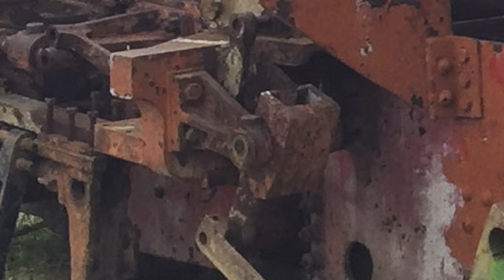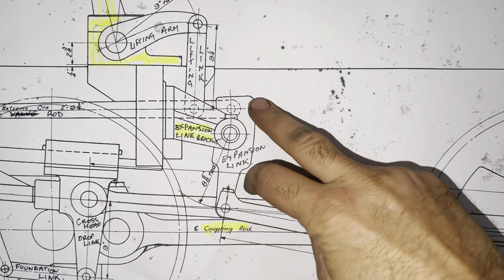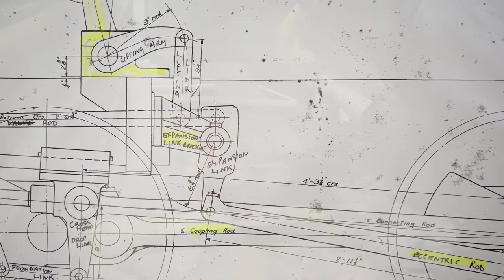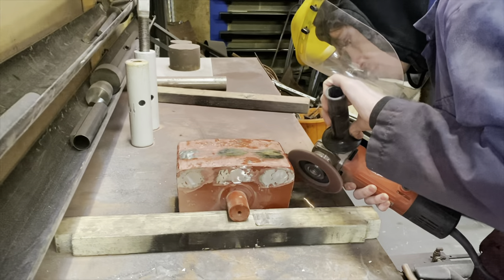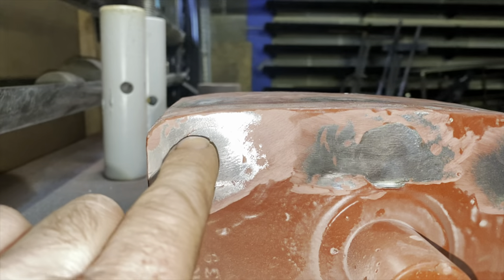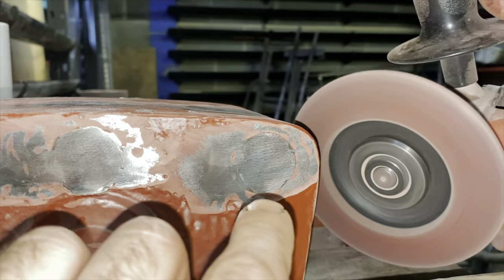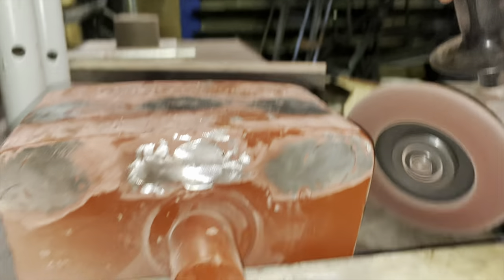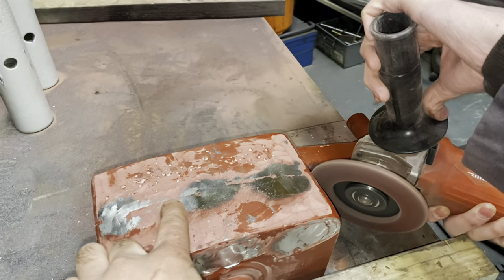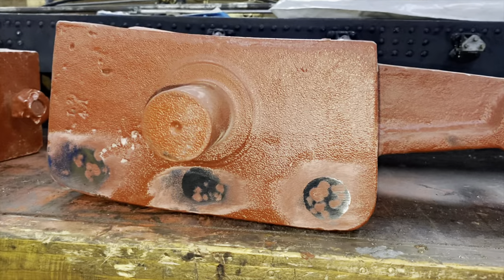This is our engine before we started restoration and before we took the parts off and cleaned them. Next, on to the expansion link itself, which obviously has to pivot on that bearing we just saw made. This was actually two halves that were pinned together with three pressed pins right the way through. We ground the riveted overheads of these pins down — there were tack welds as well — so we're skimming up to take away the tack welds to clean it so that we could get it in the press to press out the pins and separate the two halves.